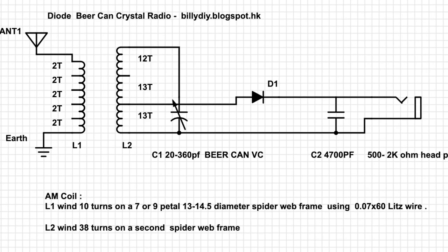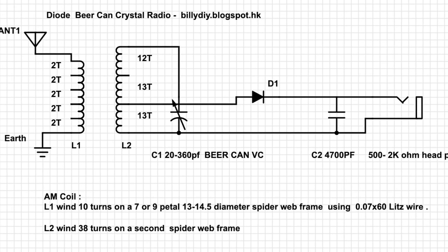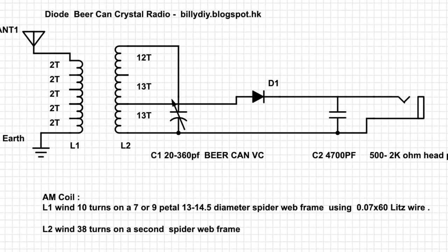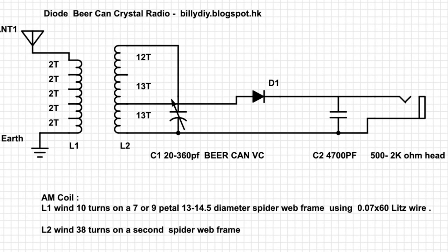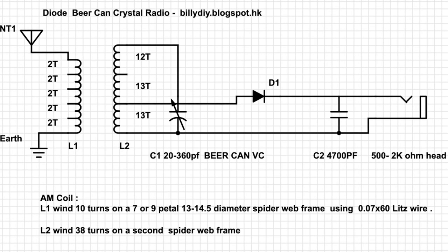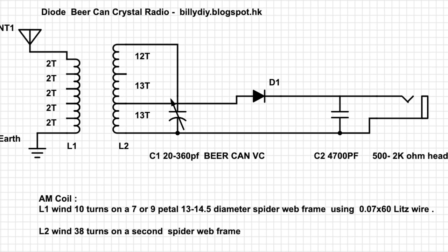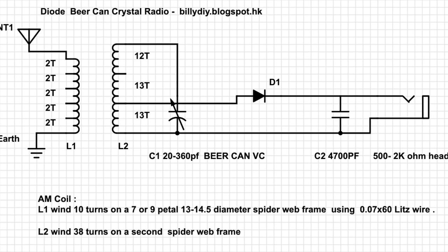Also, I find that this way the variable capacitor value will be unstable, sometimes big, sometimes small, sometimes just suddenly drops, and sometimes increases to a super high value as if it's a short circuit. So in order to avoid that, I think it's better to use a thin film, plastic film, or if you can find some better insulator that will not affect your Q so much, to insulate between the inner can and the outer can.